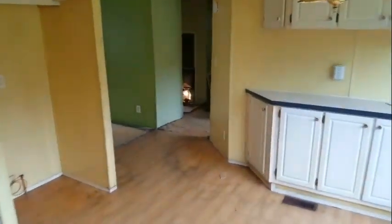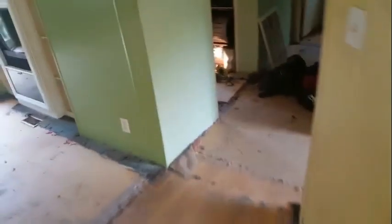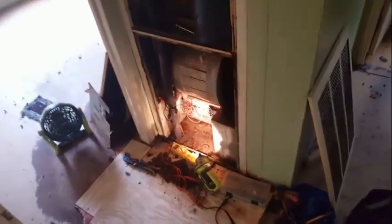Down there at the bottom, you can see a little insulator there. It looks like our heat kit's been changed at 1.2. Probably burned up. We'll see why that is. Maybe airflow related. Lord be with me. Well, looky there. She's alive. It's vibrating a whole lot less now that we got some of that stuff out of there. Let's see if the condenser comes on too. See if we can see it out the window. Nah. Alright. So the blower's on. That's half the battle.